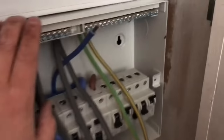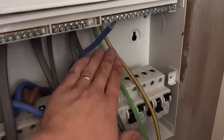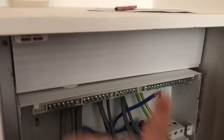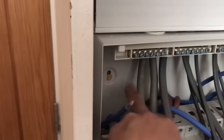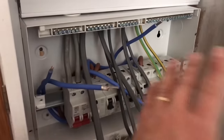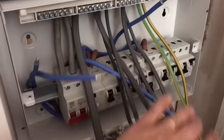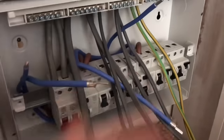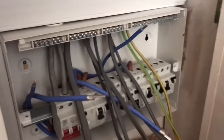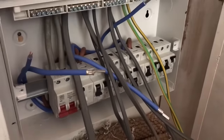There's me, gas and water, and I've just got to bring a main in. I've drilled another hole in the back of here and that will come in through the same grommet as the tails. So now I can finish all the second fixing, come here, do all my dead testing. I like to do it before I put it away because you've just got to take it out again, and then I'll put it all away nice and neat. I'll probably stick on a time-lapse when I make this off.